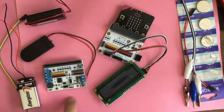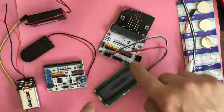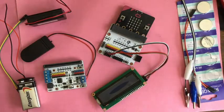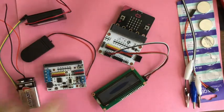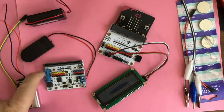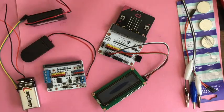Both boards do that voltage switching, and there is a switch for going from 3 to 5 volts. Same with the Motorbit — there is a switch to change from 3 to 5 volts in case you don't need the 5 volts for those pins. The Motorbit also has things designated for motors.